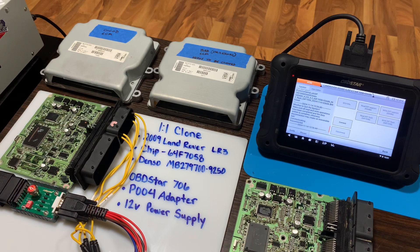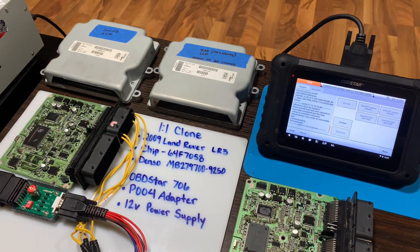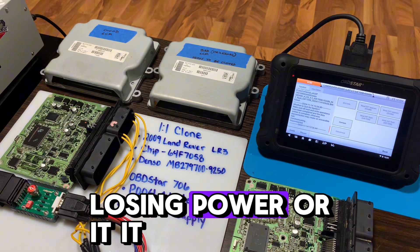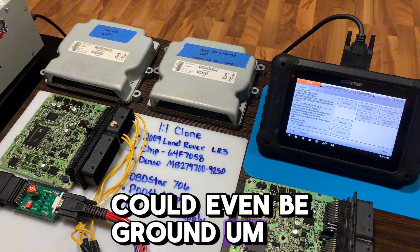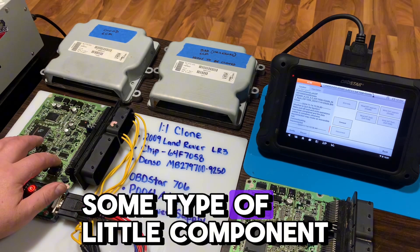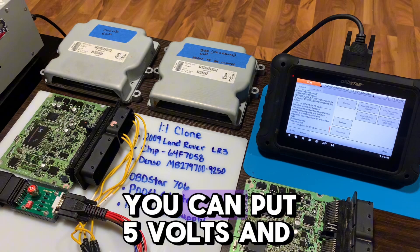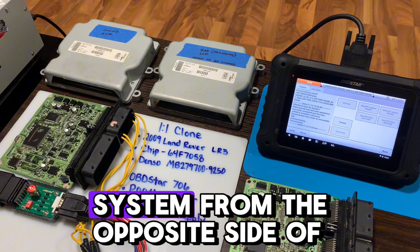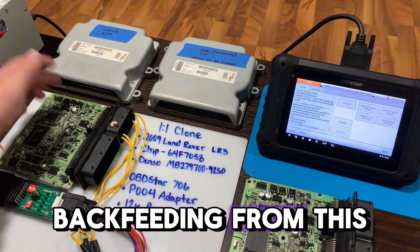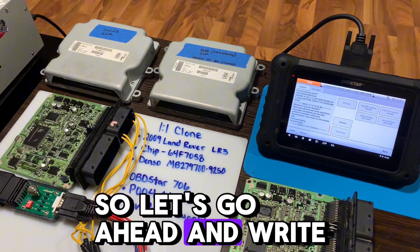All it took was putting five volts to that back pin and it was enough to get that thing to read. So if you ever have issues where this little light on here is not coming up, it's a good idea to go in and test with a multimeter and see where you're losing power — it could even be ground. Sometimes with a magnifying glass you might see a burnt component. You can put five volts and basically back-feed the system from the opposite side of where it should be taking power from.